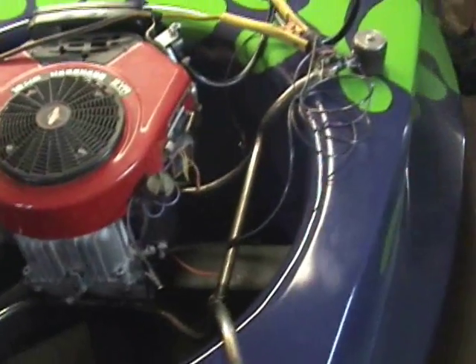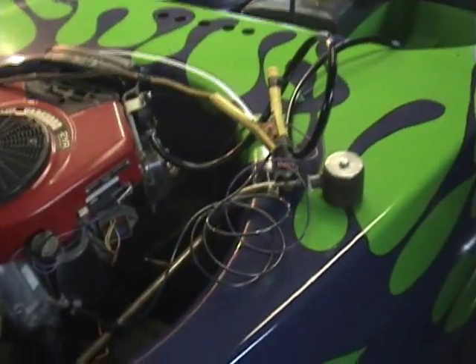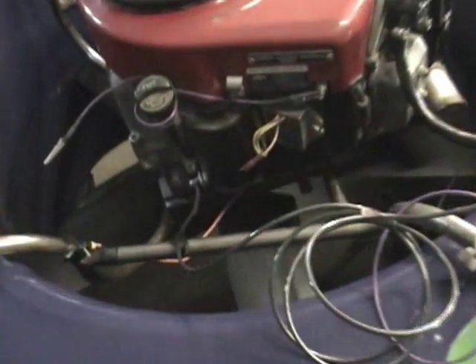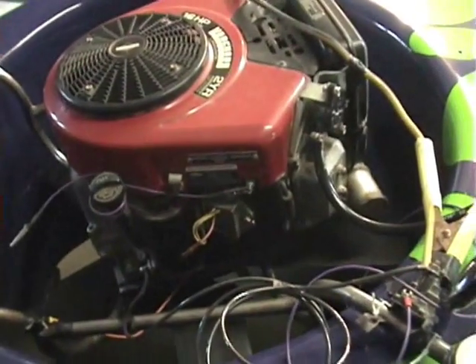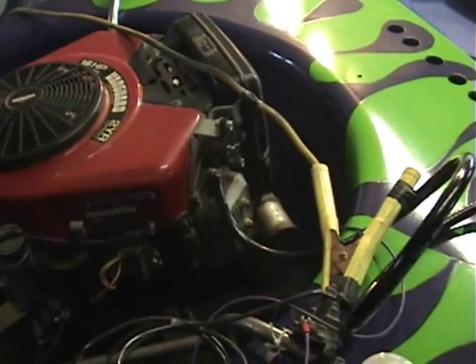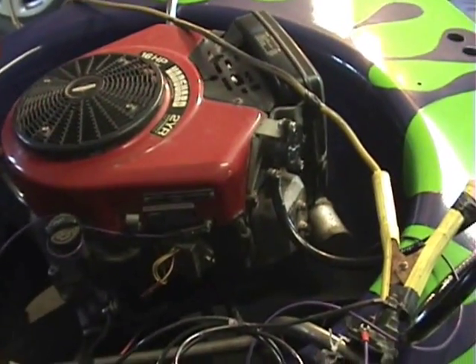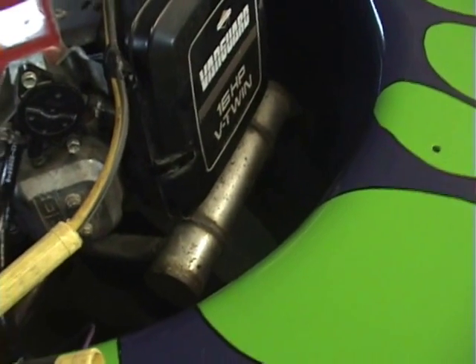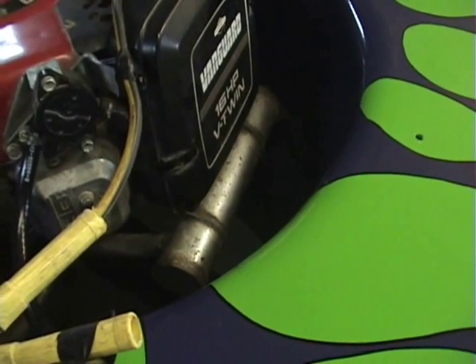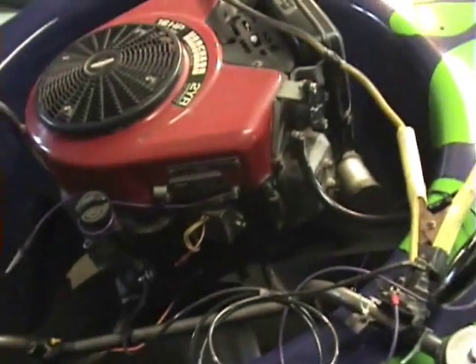As you can see I've got some cobbled-up wires here, just enough to get me going. I've got my main power running down to the starter. The lug on the starter is actually a little loose, so I'll have to take that apart and get it fixed. I've got my kill wire right there — it connects on the side of the motor and I can ground out the magneto and kill this bugger if it gets out of control. I don't have any of the throttle cables or choke cable hooked up yet, and the governor is still hooked to the motor. You'll notice it runs kind of high. That's a little home-built muffler I threw together a few years ago — it really doesn't quiet things much at all.